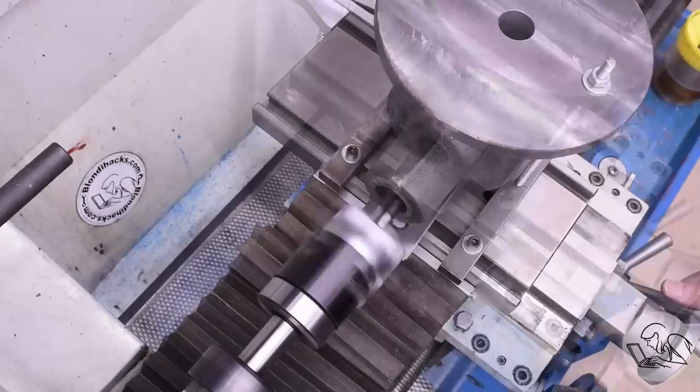This is going to be a very interrupted cut for quite a while because there's a lot of foundry scale inside there that I frankly should have sanded out first, and the core is not very centered. So we're going to be cutting a lot on one side for a while and that boring bar is going to take a bit of pounding on the foundry scale. But this is actually a really good use case for brazed carbide, as I happen to be using here. Brazed carbide is much better at interrupted cuts than carbide inserts are, and the carbide can handle the foundry scale much better than high-speed steel could. If I was doing this with high-speed steel I'd probably be resharpening that tool six or seven times during this operation — but with the carbide I didn't have to touch it. And being brazed carbide, it never chipped.